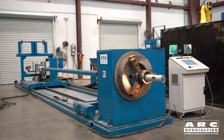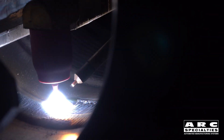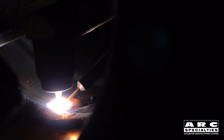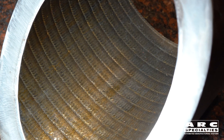So the first thing we did is we started to use a technique that I used way back in the early 80s on a nuke job — we used outboard steady rests. This allowed us to oscillate. Because if you oscillate, you can put down the same amount of metal per hour, which is deposition rate, which is efficiency, but you can rotate much more slowly. The problem with stringer beads is when you're rotating very fast, you tend to outrun your gas shield and then you get a lot of oxides. Most of the Inconel defects that you'll ever see are oxide inclusions. So our goal was to reduce the surface speed and avoid these oxide inclusions, and we did pretty well with it.